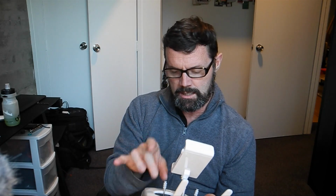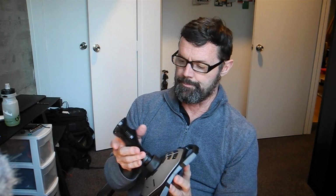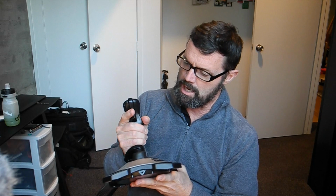So what I'm hoping to do is take the guts out of this, take the potentiometers from these sticks and transfer them to this, so that eventually the pitch and the roll and the yaw will be controlled by this one joystick with my whole hand, and the larger distance for the rotations of the potentiometers, allowing for much finer control of the motions. And the fourth variable will be throttle, which I'm hoping to get into this controller here. So I'll fly the aircraft like this.